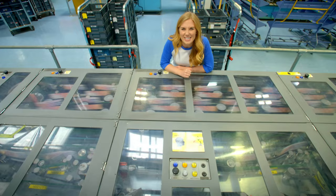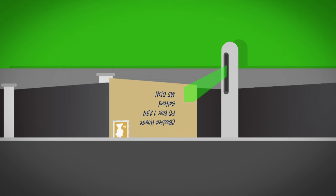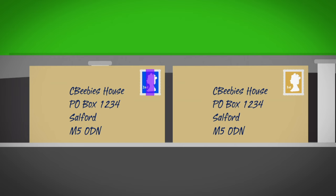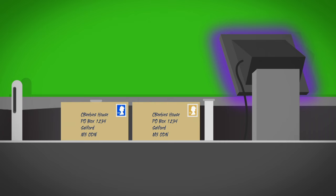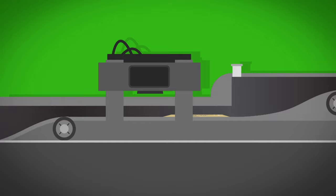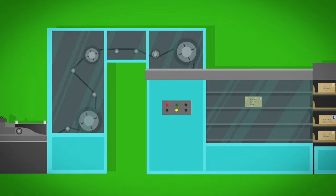When the letter goes into the IMP machine, it can tell which way up the letter is, because the stamp is always on the top right-hand corner. If it's upside down, it turns it the right way round. Stamps have invisible strips of special ink on them called phosphor ink. There are two strips for a first-class stamp and one strip for a second-class stamp. The machine has an ultraviolet light inside which can tell which stamp it is by counting how many strips it has. The letter then passes under a camera which reads the address and the postcode. The machine turns the address and postcode into a number and prints it as a series of lines on the envelope — this is called a plan code. The plan code is what's used by all the other machines on the letter's journey to get it to the right place.